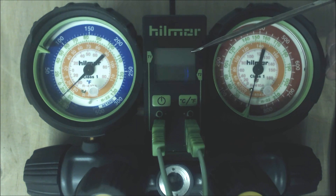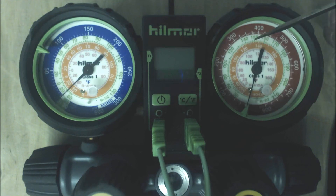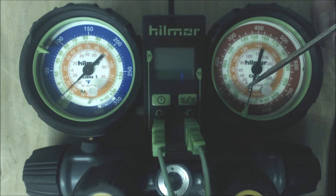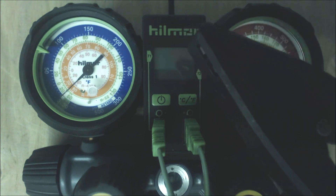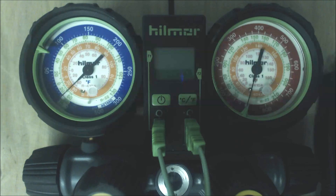There's a pressure-temperature chart basically built right into your gauge set. So at 175 PSIG, with a saturated temperature of 91 degrees in the middle of the condenser coil, if on the temperature clamp we read 79 degrees on the liquid line, then we would be good. The subcooling is a temperature decrease in liquid form from the middle of the condenser coil to where it comes out at the service valve — putting the temperature clamp right on the liquid line by the service valve. So it's a temperature decrease from 91 to 79, which equals 12 degrees of subcooling.